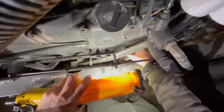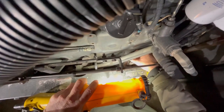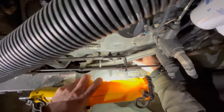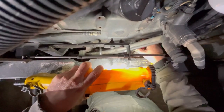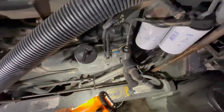Then I'll be ready to jump up to these two filters right there. Once the fuel goes through these three filters, it's definitely clean before it gets up to the pump. There it quit shooting air out of it, so it stopped spitting air — turn it back off, and there you got it. That's got that bottom filter with the air bled out of it.